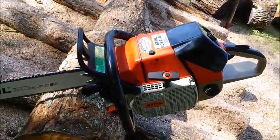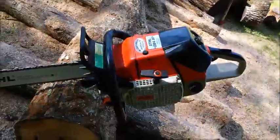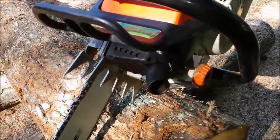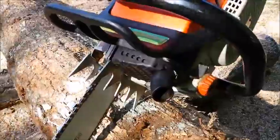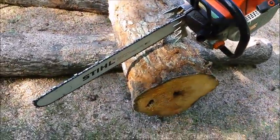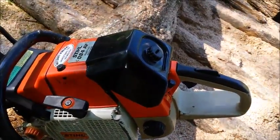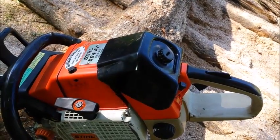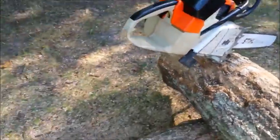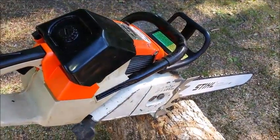But I'm a nostalgic guy, so the hell with a MS 880. You can see wide open exhaust — that's about a one-inch hydraulic fitting brazed into that cover. New 25-inch bar and chain, RS chain. I got the max flow on sale one time — I forget where, might be Bailey's or something like that — but it was like 35 bucks, usually almost $70. Labor of love for sure.